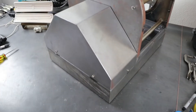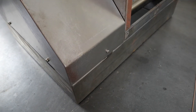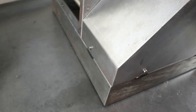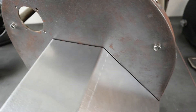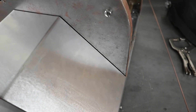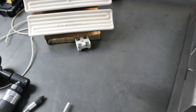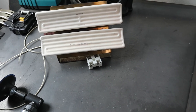We got the cover all mounted up. I drilled and tapped the holes, transferring them from the cover onto the tabs one by one so I'd have a perfect fit with no misalignment — that turned out pretty good. I also put some shims on there to give it space between the main body of the roaster so it's not rubbing and taking the paint off, since things will expand and contract with heat cycles — just left a little room for safety. The last thing to do is mock up the heaters and get the little splitter mounted somewhere.